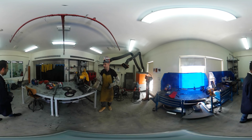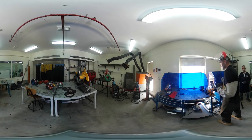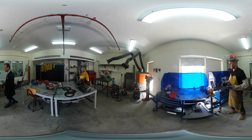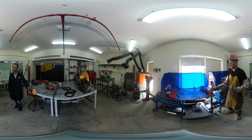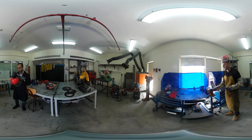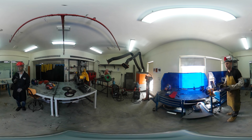On to the next step — using the grinding wheel. We have a grindstone and a sanding belt here. They are both used for removing any excess material from metal. Again, like with the cutting wheel, we only want to use steel on these two machines, because if you used aluminium or plastic, it would get stuck in the pores of the wheel, which we don't want.